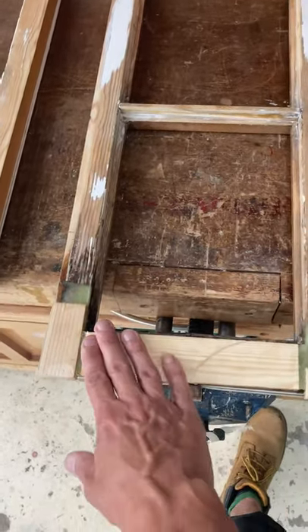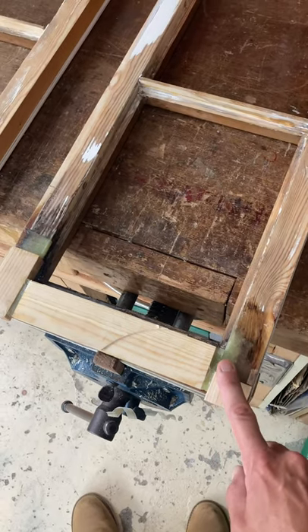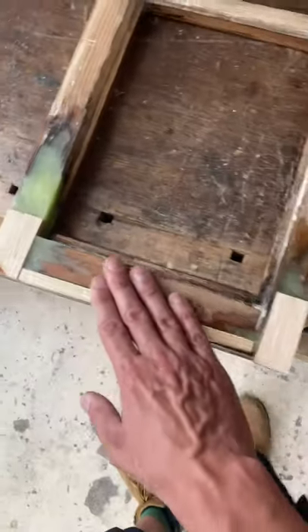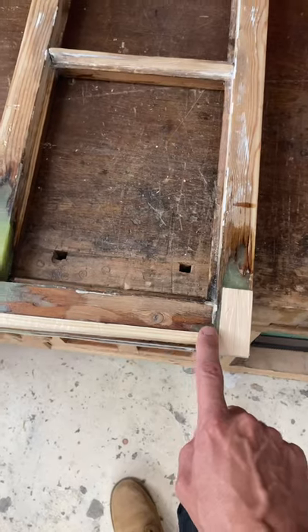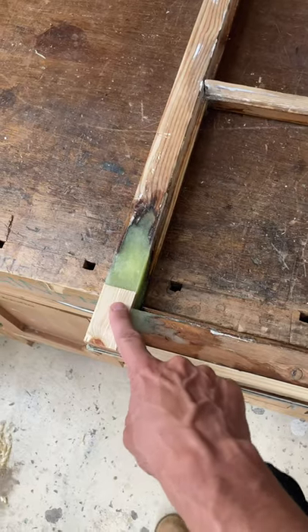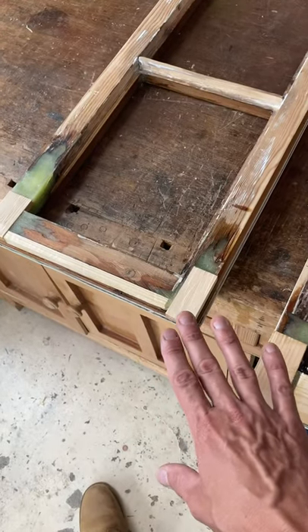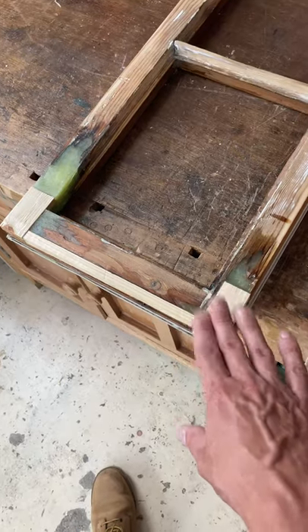I haven't actually bothered showing the physical use of the resin — there are loads of great videos by Repair Care on using their resin. Mix it well, smush it in, add your pieces of wood — it literally is that simple. The nuances are technique with the knives, which isn't actually that complicated, and using shuttering to border the edges. These are only partial splices added onto existing wood, so it's no harder than sticking two pieces of wood together with epoxy resin. We've left it for 16 hours for the resin to go off.